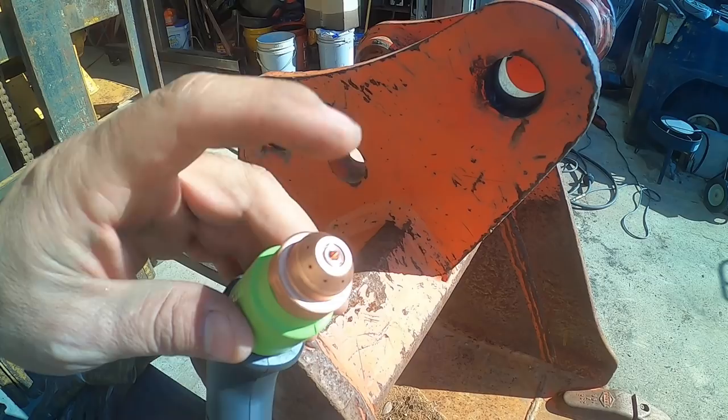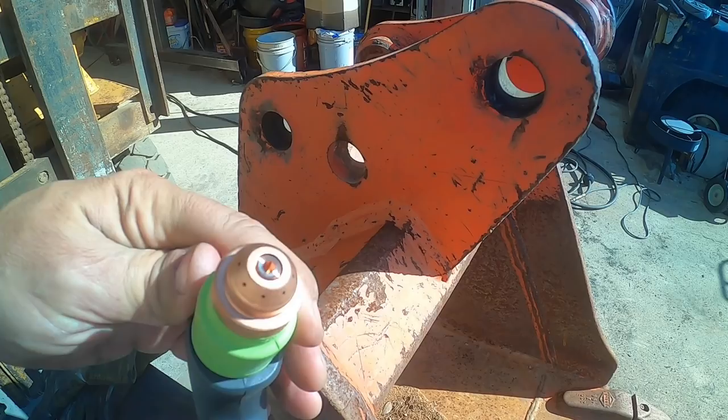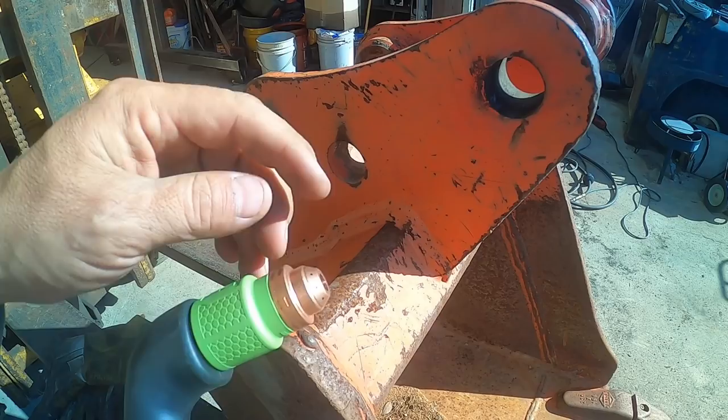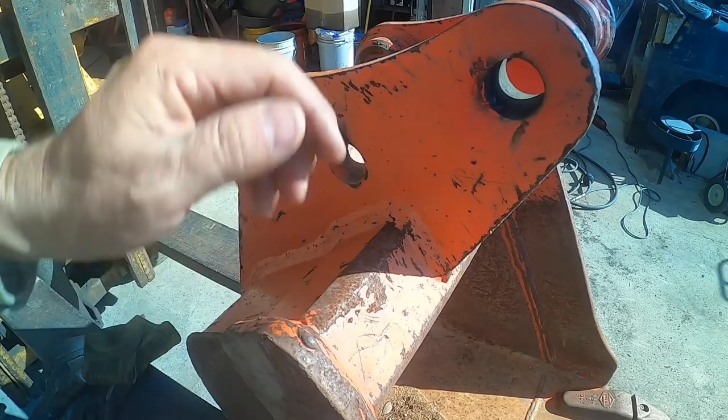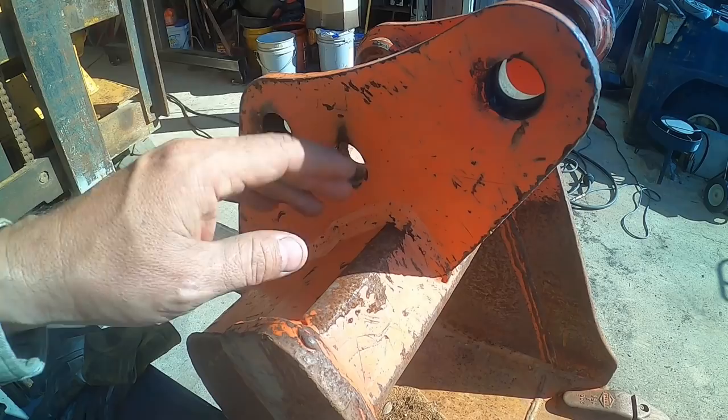Okay, so I've swapped out buckets for this other one to get these off, and I ended up changing the tip to the max removal tip, and it's still at 45 amps. So I'm gonna see how that works. The other one was very fine, in that it seemed like the center compressed air jet was very narrow. So we'll see how this does here and on these other sections up in here. Again, it won't fit in some of these spots, but I'm gonna try and go around them or avoid those areas, and then I'll just get those with the carbon arc gouger. Okay, here we go.